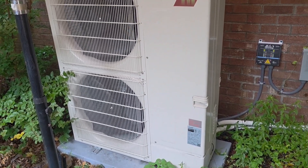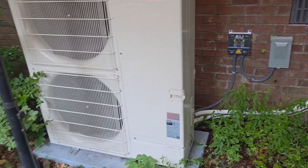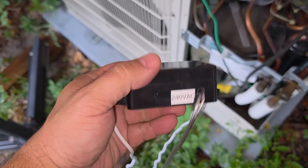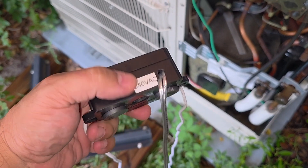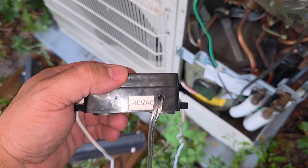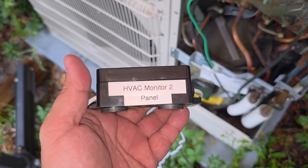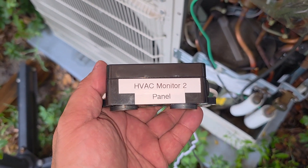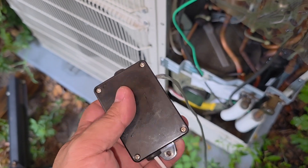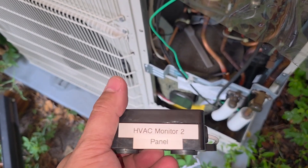We've got a little tent set up because it is a very rainy day, but we're going to be installing some of the sensors here and the rest of them at the indoor unit. This is the outdoor module. This has the wattage sensors that will help us to determine the speed that the inverter inside and outside is running. Normally this would go in your electrical panel, because that is where the indoor and outdoor unit high voltage feeds tie into a central location. With this unit though, the indoor unit is powered by the outdoor unit, and so the central location where those high voltage lines split off is actually in this outdoor unit. So that's where we're going to mount this.